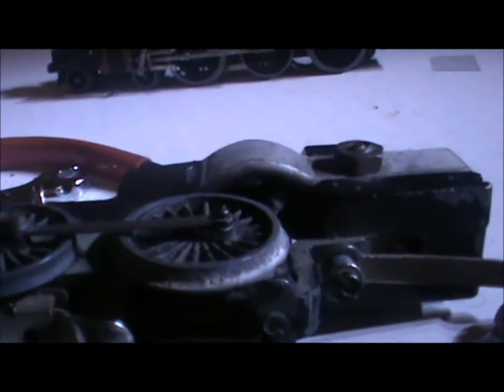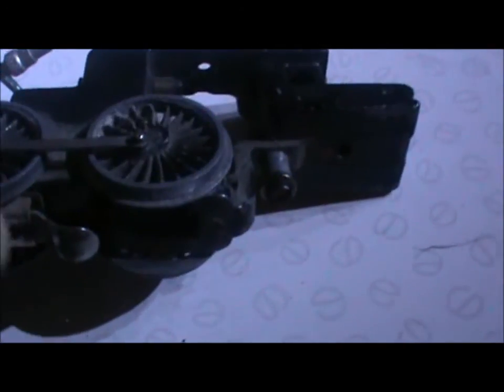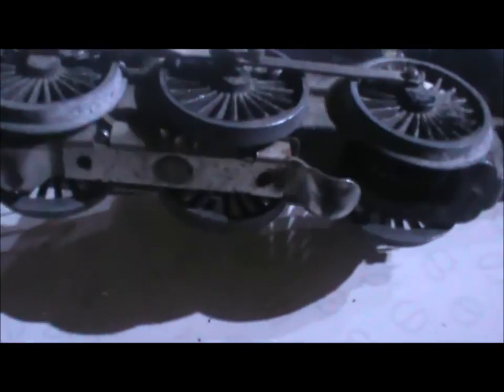But it starts with taking it all apart, cleaning and servicing, so that's what I'm going to be doing for the next 20 minutes or so. That pops the armature out. I think this chassis is probably going to be fine — it is stiff, but look at how much fluff and crud it's accrued over the years, it's hardly a surprise. Look at those wheels, corroded, so they're going to want a lot of cleaning. The motion rods I'll give a little straighten up. There's bits falling out as we rotate it, but I think this will be fine.